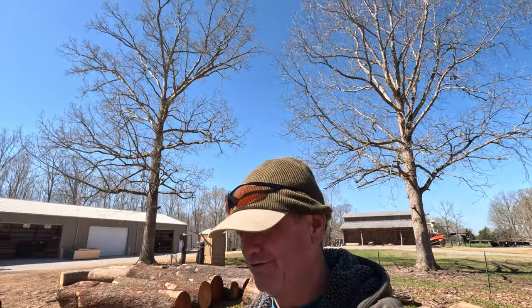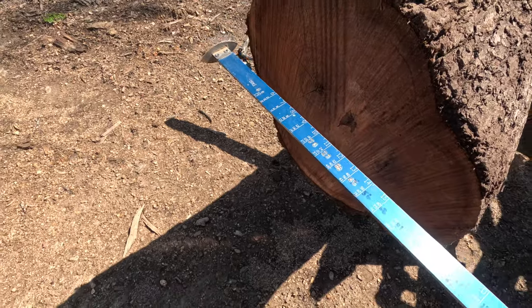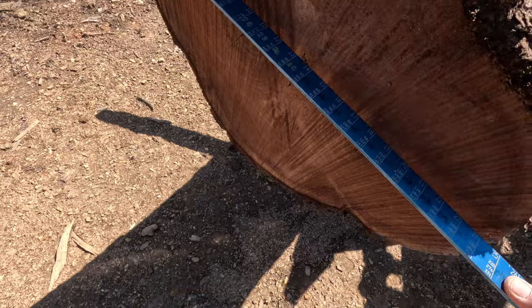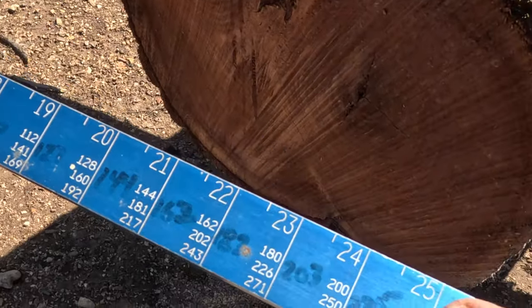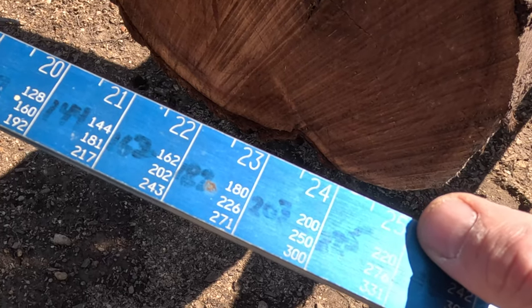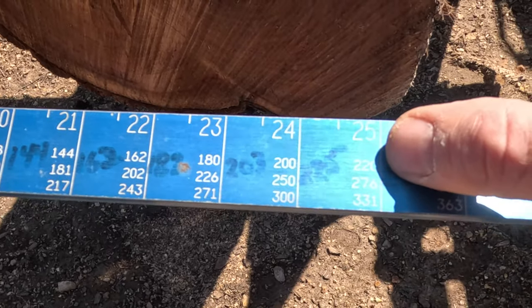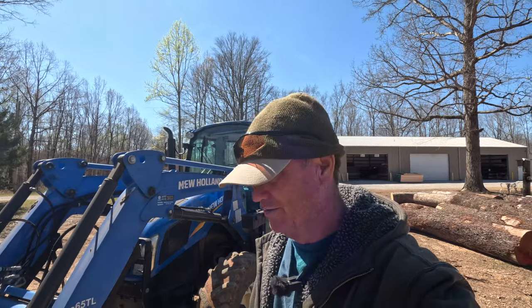Let's scale this log. Dropped my stick. So this is actually a good one to show you how to scale. Remember what I said — you always pick the narrow diameter on the small end of the log. If you're scaling and you're trying to sell the log, you would hook one end right there, come down here, find the widest point — say this one is 25 inches wide. Then when you come to 25 inches and it's eight feet right there — this line is eight foot, this line is ten foot, this line is a twelve-foot long log — so 25-inch diameter, small end of the log, eight foot: this log would be projected to have 220 board feet.